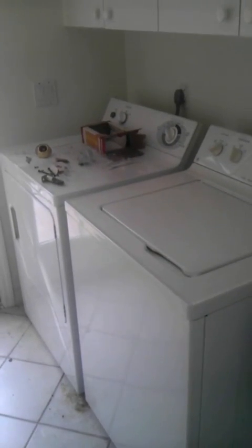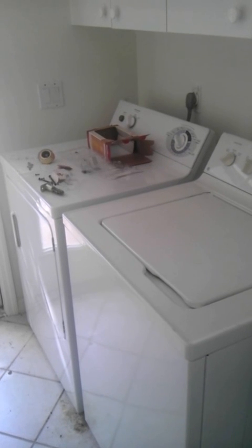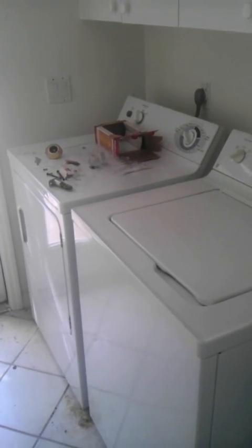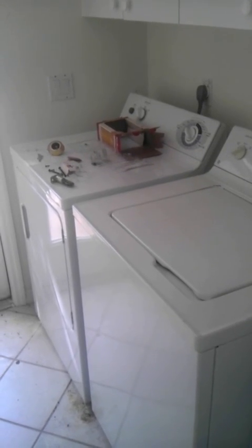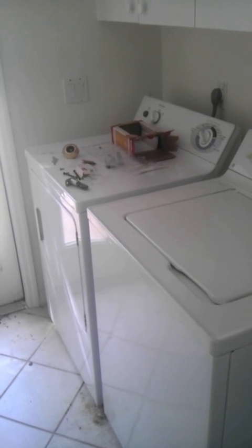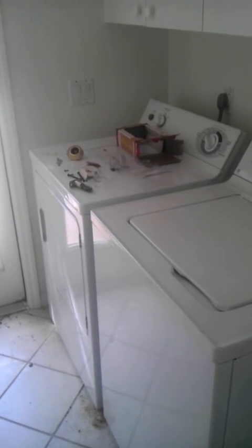What I did now is I shut off the blower door fan so we can cut the noise. What's happening here basically is the vent from the dryer that goes to the outside has a damper, and that damper should only open one way so it vents the air from the dryer to the outside. If that damper is loose, with the blower door fan on depressurizing the house, it's going to bring in outside air into the home. This will also happen with a mechanical system such as your air conditioner when it comes on — it's going to pull air through paths of least resistance.